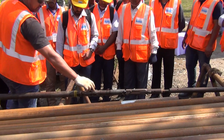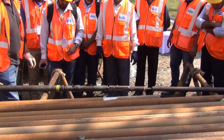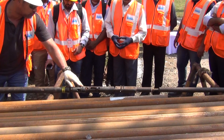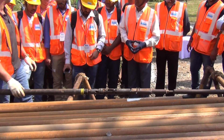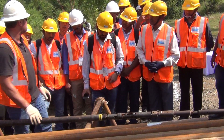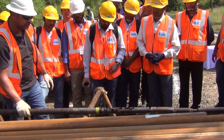The landing shoulder seats in the landing ring. You need to check this as well — if it's worn, you can pick it off, turn it around and use the other side. If you don't check this, it can get jammed into the barrel and then you've got a rod pull, which is a very time consuming process.